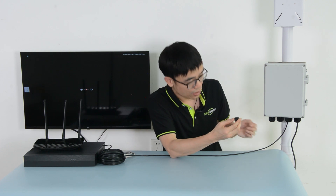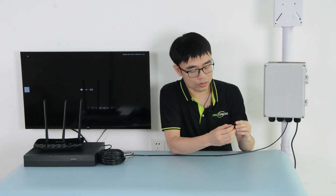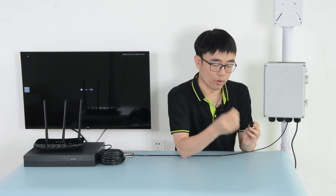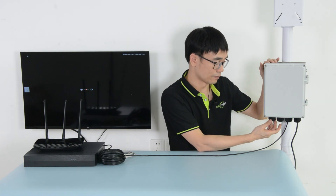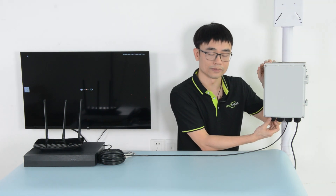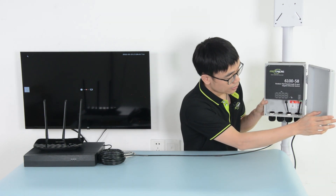I also have one of these O-rings here. All the cables need to pass through this O-ring and enter the switch. So if there's an additional port you don't need, you can use this rubber plug to block the port. Make sure you have closed the gland tightly — there's no gap between the cap and the body. That's quite important.